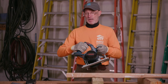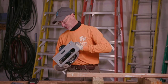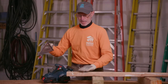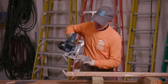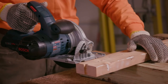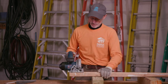Like all power equipment these days, there's a safety. You move your safety out of the way before you pull the trigger. So let me adjust the blade and put in my battery. I'm going to cut this two by four, so let me just make a mark. On this saw you'll see there's a guide that matches your saw blade. So when I want to cut along this line, I can put that guide right in front of my mark and move my blade up close. I start the blade spinning before I touch the wood and then just move it along your cut line.